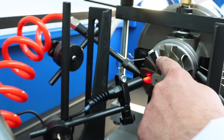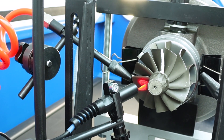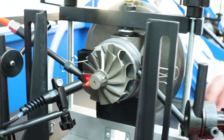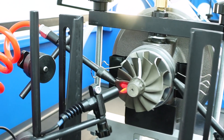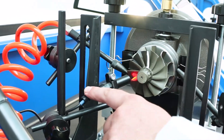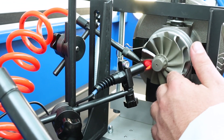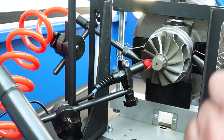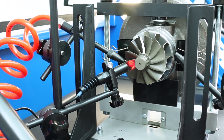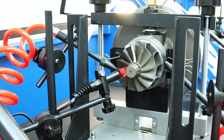A contrasting mark will need to be placed on the turbocharger rotor. The machine is equipped with two nozzle apparatuses to accelerate the turbocharger rotor. Also included is a snail for accelerating large cartridges. The photo sensor is set between 5 and 50 mm to the contrast mark. There should only be one tag on either blade. The nozzles are set at minimum air pressure, so that the maximum speed is achieved at a certain angle of attack.